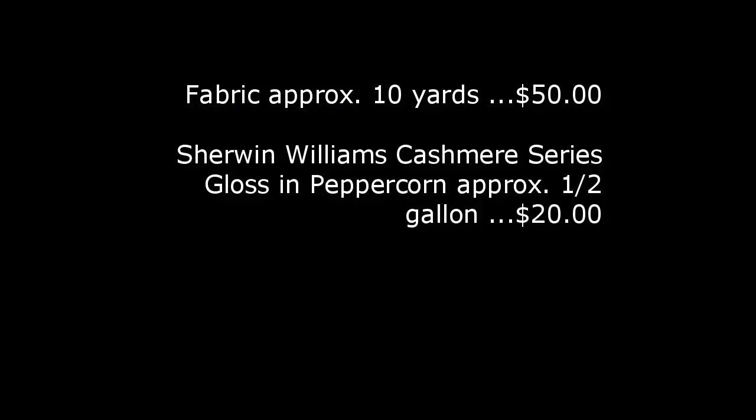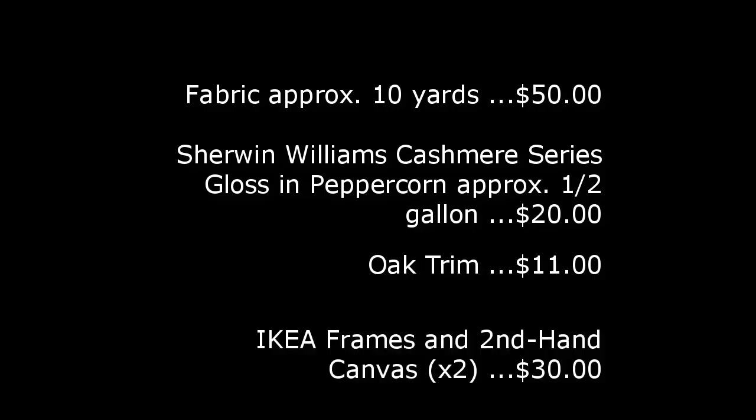The first thing I did is picked a half-gallon of paint that I had on hand. I chose a Sherwin peppercorn in a Cashmere series, and it was a gloss paint. And I know gloss kind of sounds like a weird choice for an office wall, but it actually helps reflect the light. If you're picking a darker color, you want to consider using a higher gloss paint so it will reflect the light a little bit more, because otherwise you'll feel like you're in a cave.